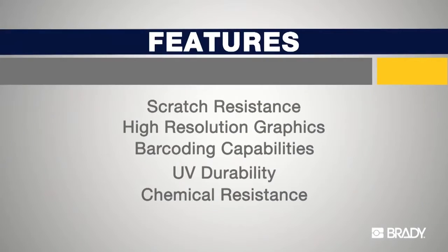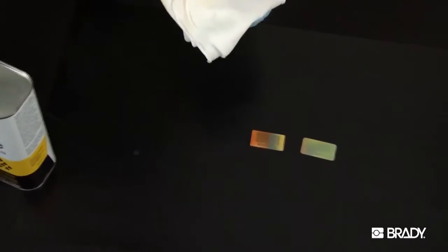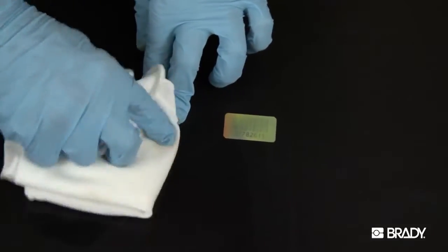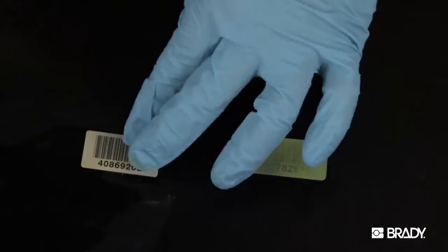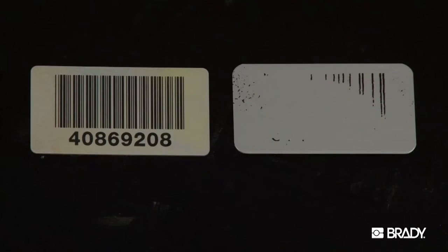The last performance characteristic of Metal Photo that we will demonstrate in this video is its chemical resistance. Metal Photo has exceptional chemical resistance to strong solvents that are used to clean up graffiti type defacement. Here, Metal Photo is on the left and a painted aluminum marker is on the right. Both have been purposely defaced with spray paint that has been allowed to fully cure. As we clean both samples using acetone, you can see that the Metal Photo marker is unaffected, while the painted aluminum marker's image is attacked along with the graffiti by the solvent.